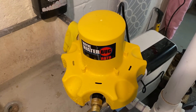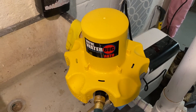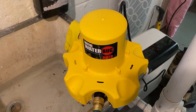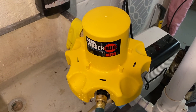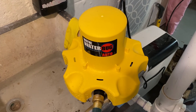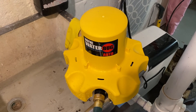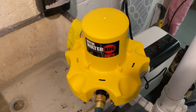This pump also has a floater on it, so it has an auto mode — it's got a little bobber built into it. The pump primes at an inch and five-eighths of water and it'll drain down to a half inch of water. With the auto mode on, you can just leave it plugged in and it'll kick in whenever your basement or yard floods.